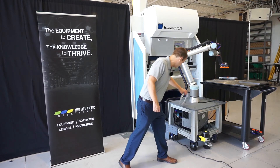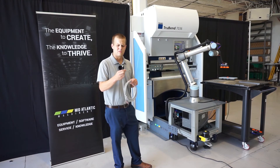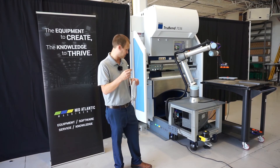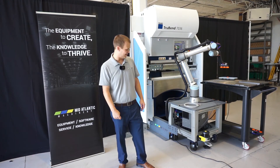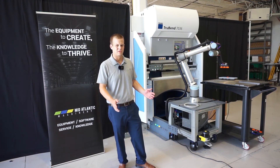Another key feature is the box down here on the press brake. We take this M12 quick disconnect cord set, and that's what integrates the robot to and from the machine. We hook and unhook that cord set very quickly, along with the 110-volt power and the air, and the robot is ready to move to another machine tool.